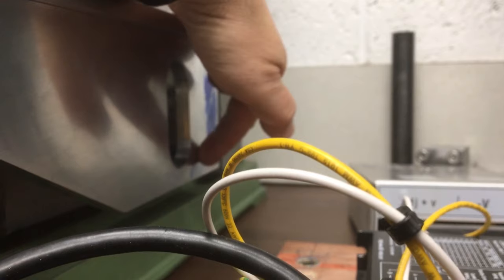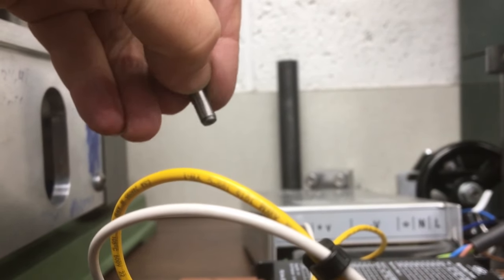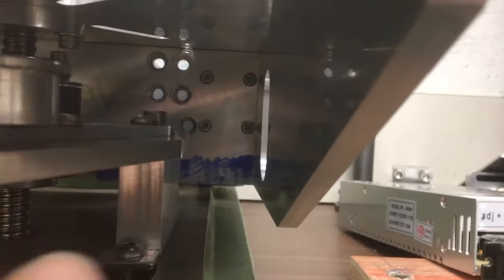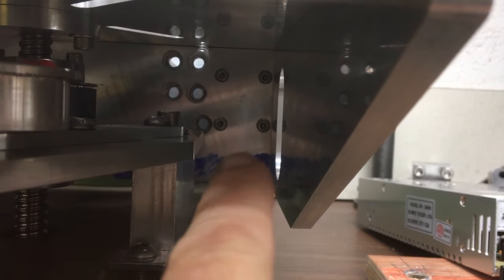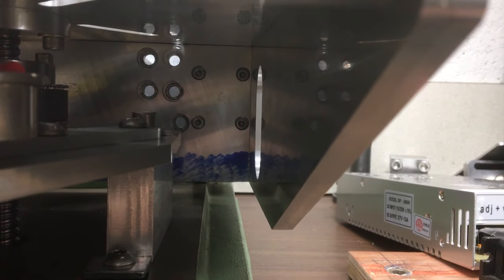My other thought was maybe put a dowel pin here, so come forward a bit. So something like this. I've got a load of these 6mm dowel pins. Obviously, I have to grind them down a bit. That would go into, if it went in forward there, and then machine up a block, say 20mm thick, that I bolt in, and then have the pin come through from the side into that block. And obviously do that both sides.